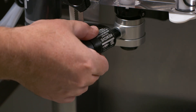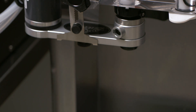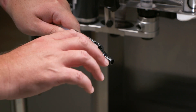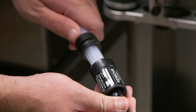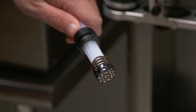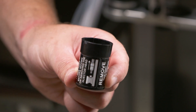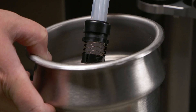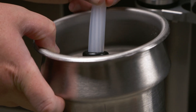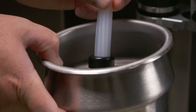Rotate the nine-tube assembly coupler until it unlocks. Remove it from the blending head syrup line opening. Unlock the coupler body by rotating it from the coupler base. Remove the coupler body, syrup line manifold, and duckbill check valve from the nine-tube assembly. Submerge these parts in detergent water. Place the end of the nine-tube assembly into a container to catch the expelled syrup and sanitizer solution during the clean-in-place procedure.